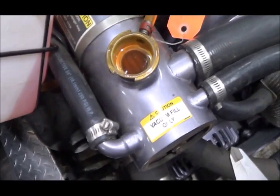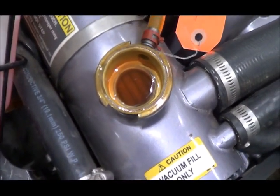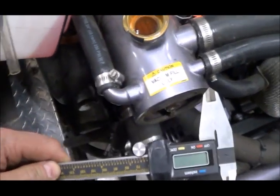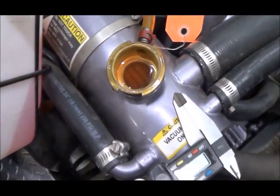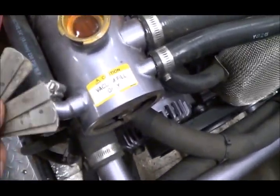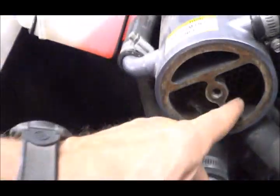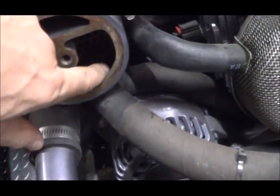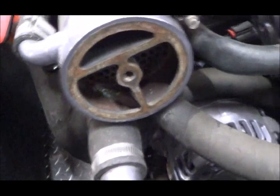On the engine coolant side of the heat exchanger, looking through the cap you can see the tubes are packed really close together. By measuring one of them, it looks like they're about 0.27 inch outside diameter — it doesn't have to be exact. Then using gauges to figure out the gap between tubes, I've got about a 0.042-inch gap. That doesn't have to be really exact either.